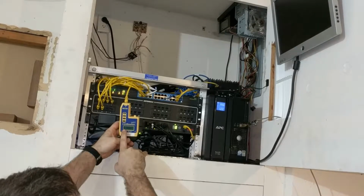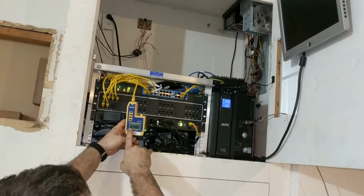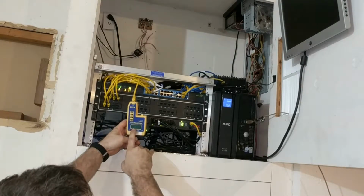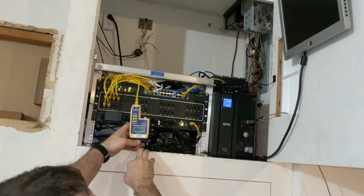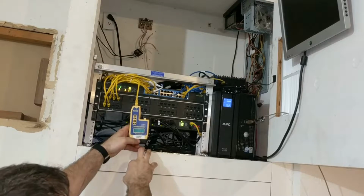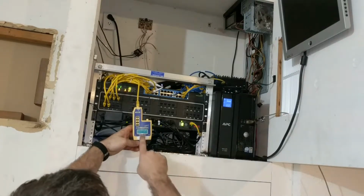it looks like, see, 5 is connected to 1, and then I'm guessing probably 1 and 5 are switched somehow here. And then 2's not showing up, but that's because it lies about 1 and 2. I'm guessing that's probably what's going on. Usually with gigabit connections, they're able to cope with pairs being backwards, but when you've got a weird arrangement like this, it's not going to work.